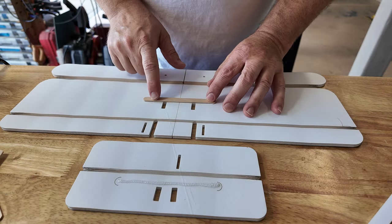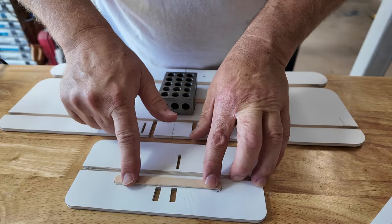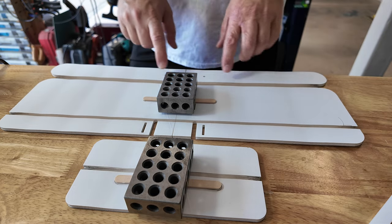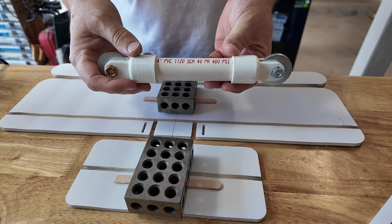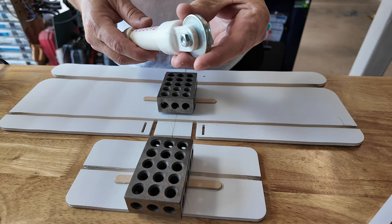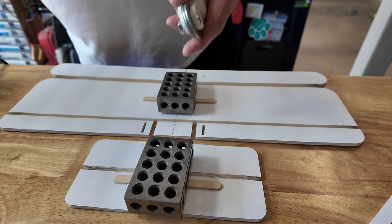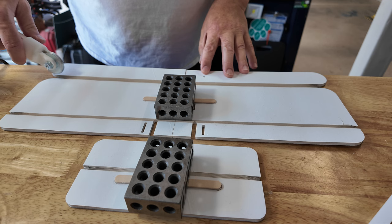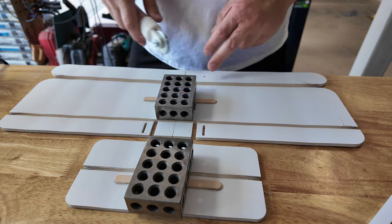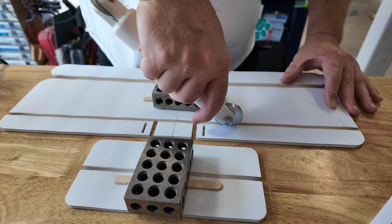Put these in, give it a weight, let them sit. This fold line - I'm going to use my little foam roller. This is a tool I made from PVC with 3D printed end caps. This side holds a single fender washer, and this side holds four fender washers, coming in at around 5.8 millimeters. This really makes for consistent folds. Sometimes the laser is subject to temperature effects and doesn't cut as well as one would hope. So I made this little tool to go in and crush the fold lines - not destroy them, just make that folding moment much easier.